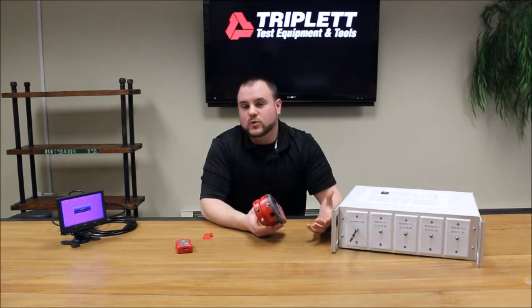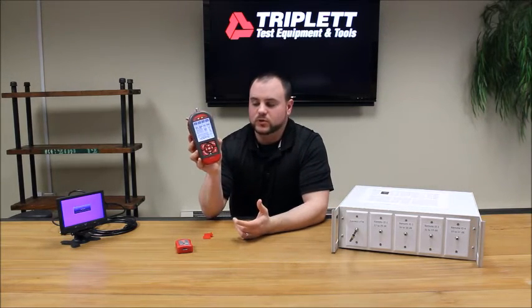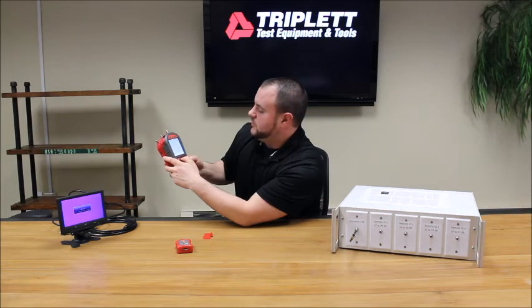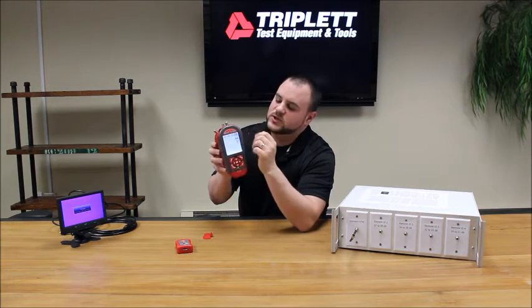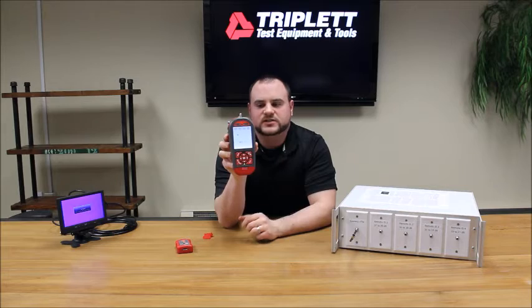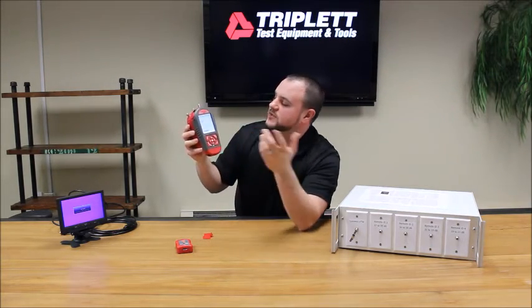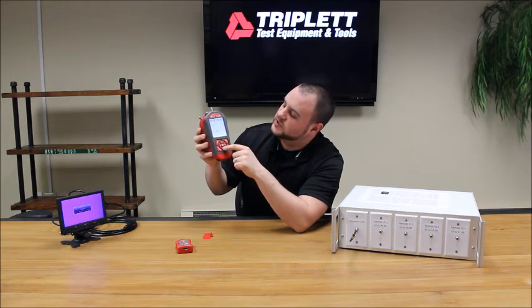Now that I've gone through all the different tests, let me show you how they work. First, turn on your LV Pro. For this demonstration, I'll turn on the backlit display so you can easily see it. To get to the different test functions, you'll have the same screen as traditionally on your LV Pro, but if you scroll right or left, you'll get a flashing X — that means you're in the expansion module. Press OK and you can see the seven tests. Use the up and down arrows to navigate through them.